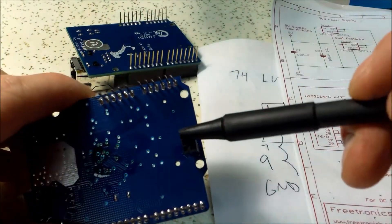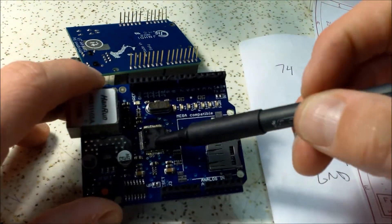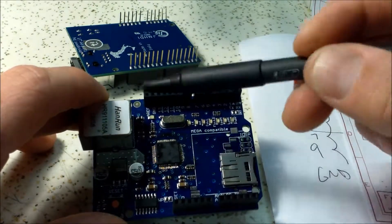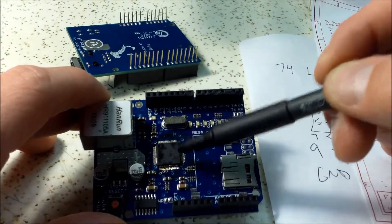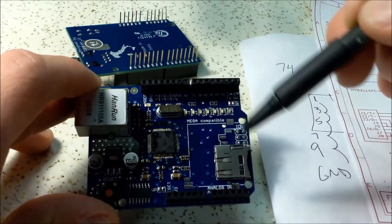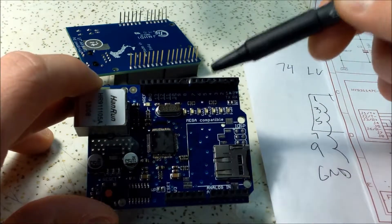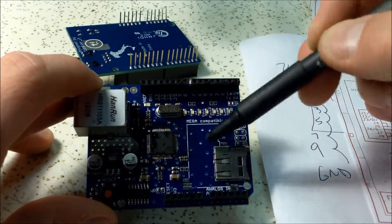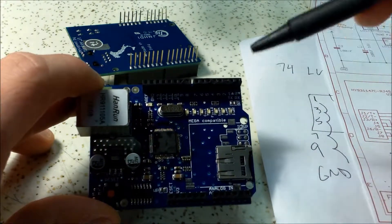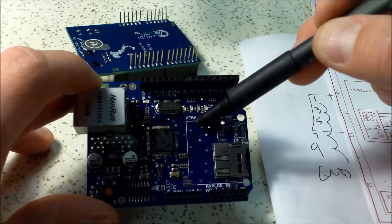This shield I broke and tried to fix the chip, but it wasn't working. I was going to buy a new chip, but it's actually cheaper to buy a whole new shield than to buy just the chip. What I don't like about this shield is that it has an SD card, and because of that there's no way to use pin 4. I don't need an SD card for my project, but I lose a digital pin because of that.